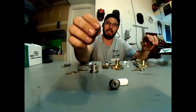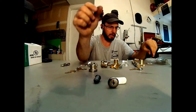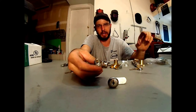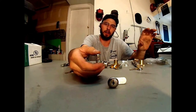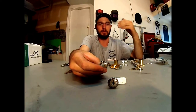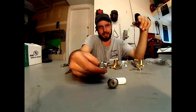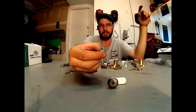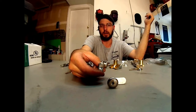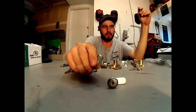This is going to be the least expensive, least secure form of lock. Basically these wafers are super easy to pick, super easy to feel. They're subject to impressioning — these locks are super easy to impression. I never mind seeing these on bike racks, car racks, hitch covers, and filing cabinets. Anywhere I see these, I know it's going to be easy to impression a key for it or just pick it and get it off the customer's car.